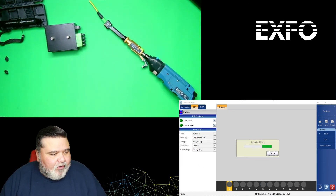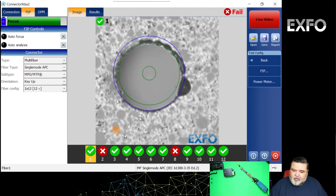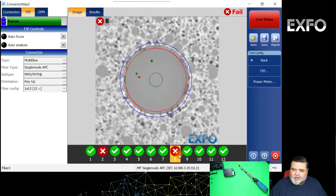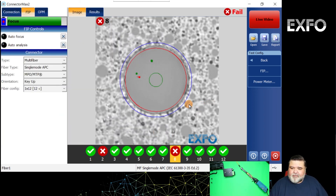Once it's complete, it's going to start to analyze. You'll notice down in the application it's starting to analyze the data, and you'll see quick pass-fail indicators on these fibers — number one, number two, and you can click across to see what they look like with the pass-fail indications. If you want to save it, you can save it as a CMAX file to use with our reporting tool later, or you can generate a PDF to send to your engineers or customers. From here you'd clean it and retest — we did have some fails here — and now we'll show what it looks like to do analysis on a bulkhead.